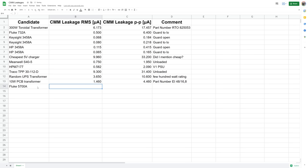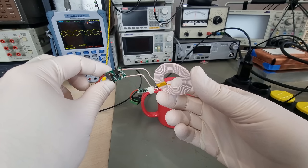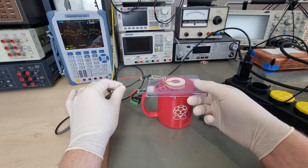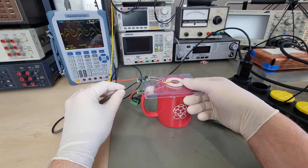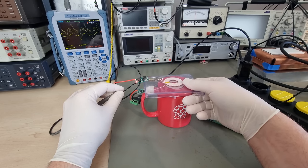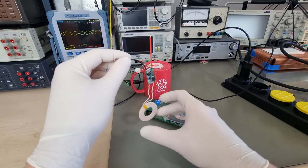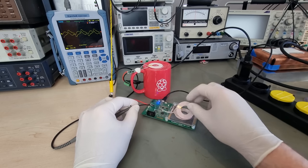Now we're going to look at a few things I specifically bought or built for common mode research. How about a Qi charger? Such newfangled tech is automatically going to be frowned upon by the graybeards — rightfully so, the normal mode noise coming out of the receiver is going to be terrible. But normal mode noise is something we can get under control with RC filtering or a low noise regulator. My next voltage standard will require about a watt of power, so if we can transfer a little more than that over some distance and get rid of the common mode noise, that would be worth exploring. We can clearly attenuate the leakage with distance, but unfortunately at a distance where the leakage becomes good, the transferred power isn't enough to supply the status LED, let alone keep an LTC 1000 at temperature. With a better send coil on some old TI dev board, it's just downright incompatible — so I'm going to have to tuck this one away as interesting with better hardware maybe, but not really viable for me right now.